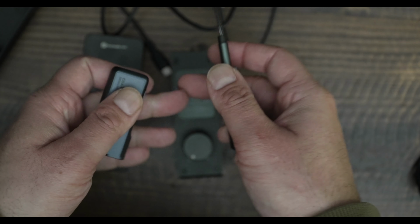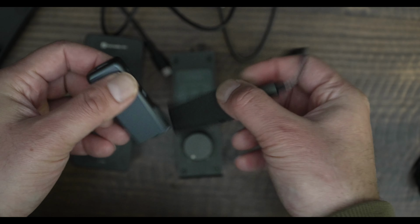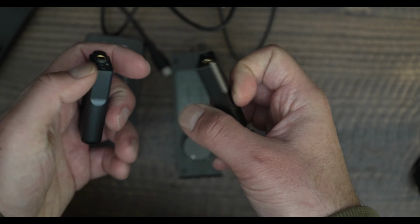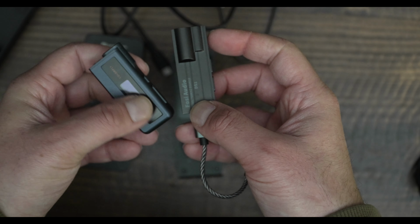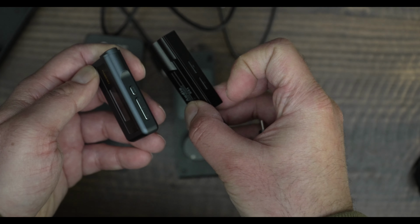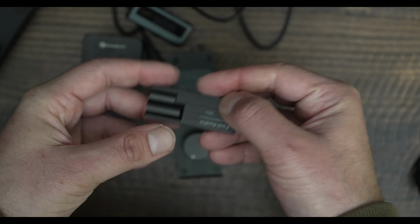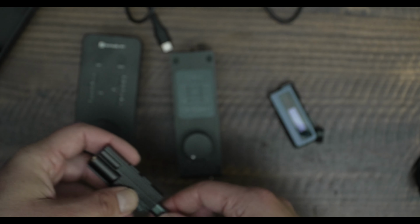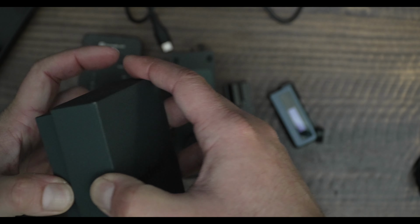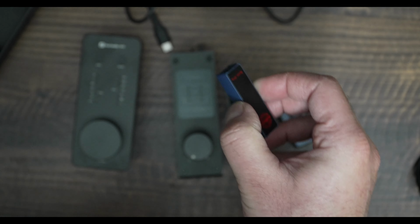Now, on the other hand, planar headphones will play differently. The DS1 is simply not created for large planar headphones that require more than 300 milliwatts for peak performance. In my experience, both the DS1 and SK2 did quite well with the Audeze LCD2, Avantone Planar, and HiFiMan Dara. However, if you have something that's very unique from the planar magnetic side that requires a lot more power, you can just dismiss the DS1 as not compatible.